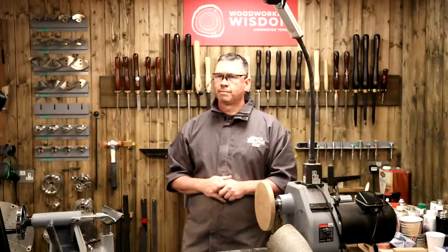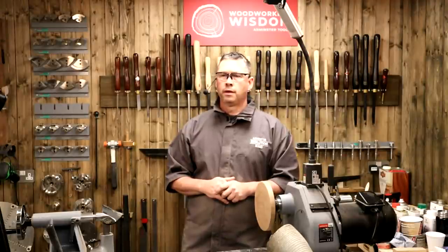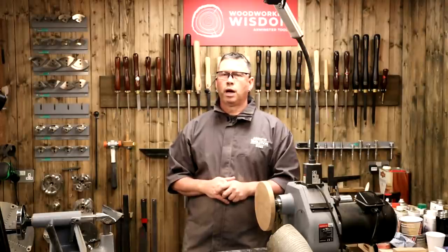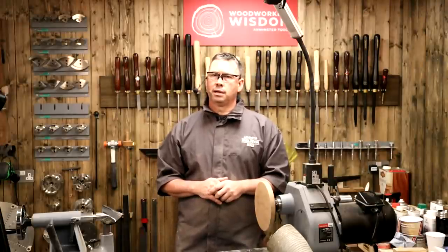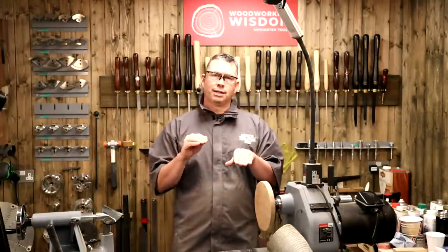Okay. From Fam, question. Any advice on how to use melamine lacquer? Tried using burnishing cream afterwards after it's cured, but seemed to take it all off despite 3 coats. I doubt whether it took it off. It might have dulled the surface a little bit. Melamine lacquer will take a long time to cure. So drying and curing are different things.